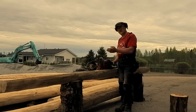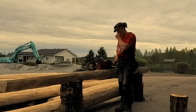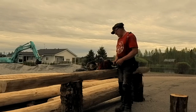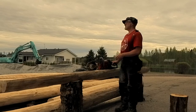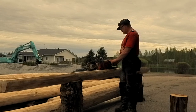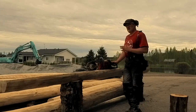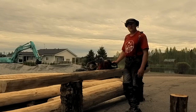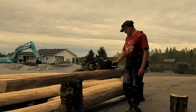Now my main chainsaw, which you may have seen, that's a 10-year-old machine and works perfectly. And part of the reason is because of these kind of tool tips. It's kind of saw care for your chainsaw. What to do on the first start of the day is to actually start the machine and then just let it run and warm up before you start with the high revs. It extends the life of the saw considerably.